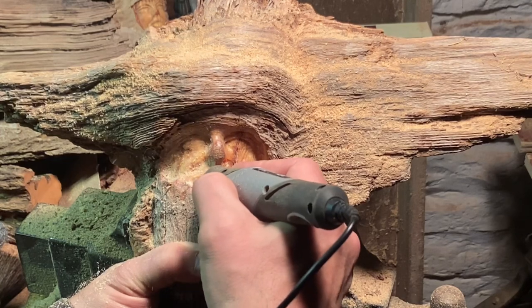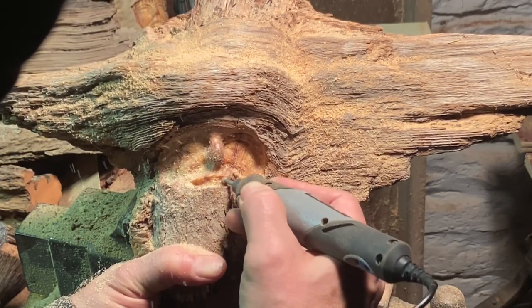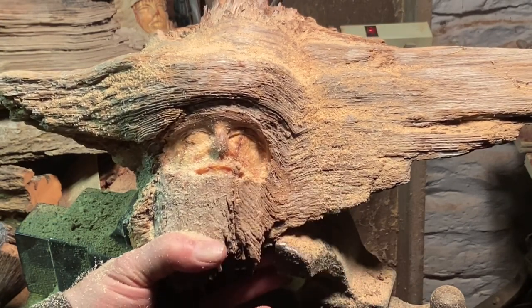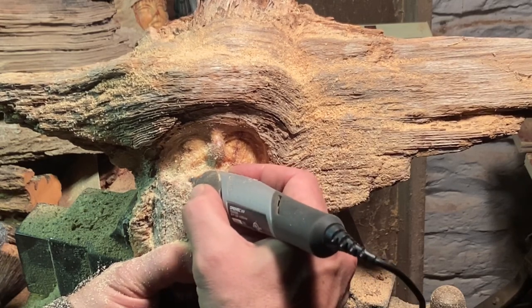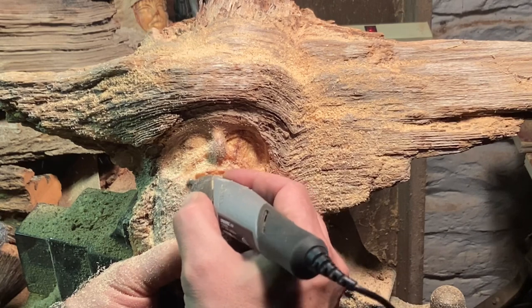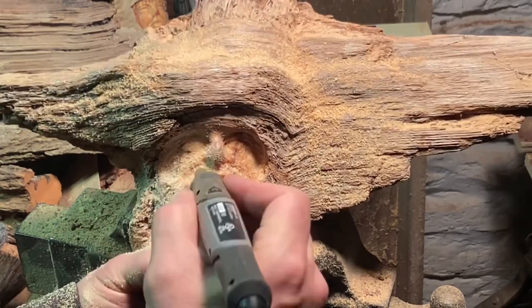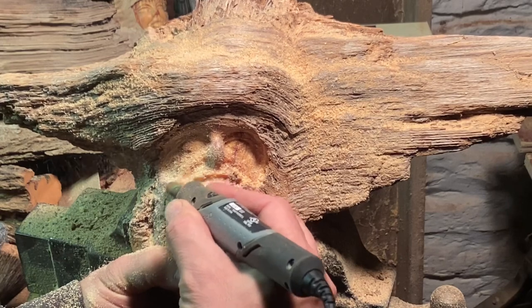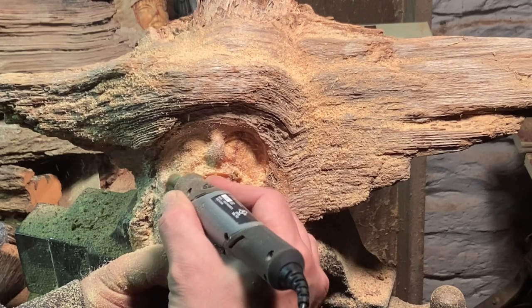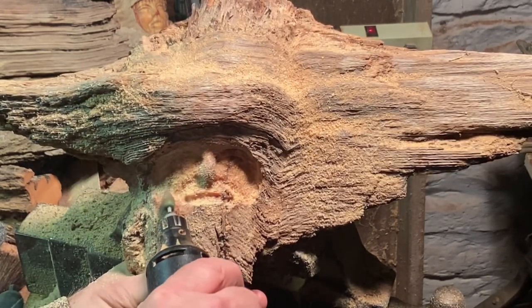I'm using carbide burrs — specifically the spherical Dremel burrs, mainly for metal cutting, and they're more aggressive. They're pretty good right out of the box; they just cut through this stuff pretty easily. But after a while they tend to get dull, and there's not much you can do with them unless you're a master machinist who can redo the edges. With the way prices are going up these days, it's probably beneficial to somehow recycle these burrs.